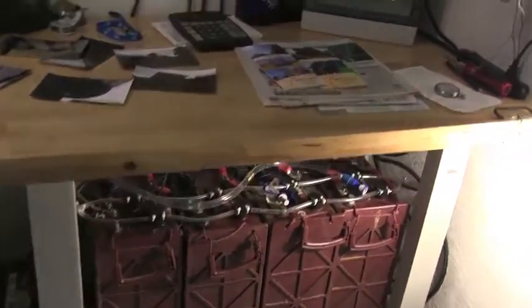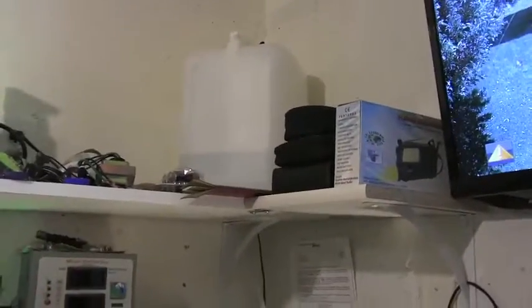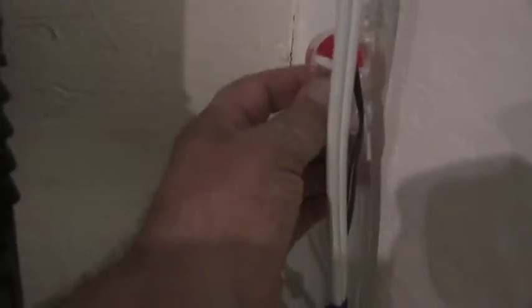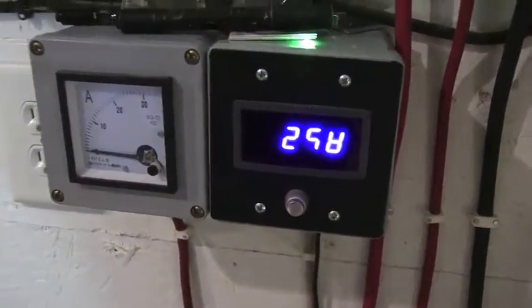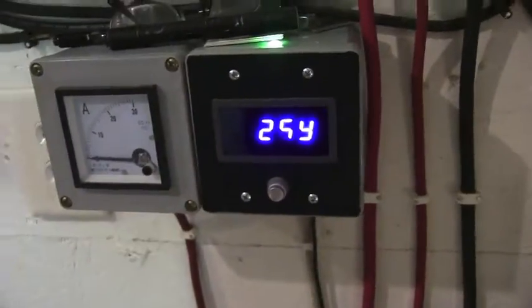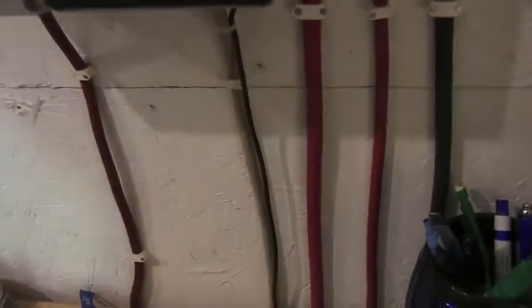This is called Water Technology. They give you this five-gallon jug and they give you all the tubing and they give you this little dial here so you can see if water is going into your batteries — if it spins, you know your battery is taking water. They give you this little light, which I stuck inside this box. This is really my battery box — it tells you where my batteries are at. If somebody had a box that their batteries are in, they can put this light outside their box. It's got a pretty good long cable on it. It goes all the way down to your batteries.